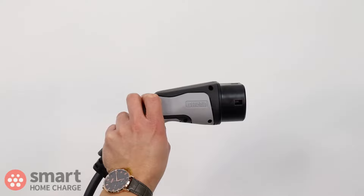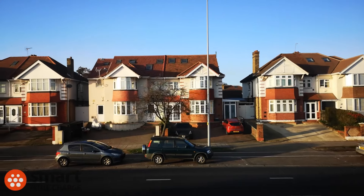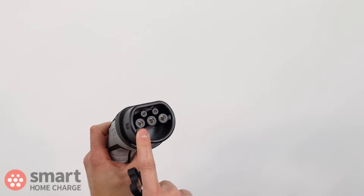On a side note, the Wallbox charging gun has two missing holes. Don't worry, they aren't actually missing — these are only needed for the 22kW three-phase version of the unit, and since most properties can't make use of that, Wallbox has obviously decided to remove them. We've had some customers worry that it's the wrong charger or there's a fault with the charging gun. So if your charging gun looks like this and you've ordered the 7.4kW unit, then that's absolutely correct.